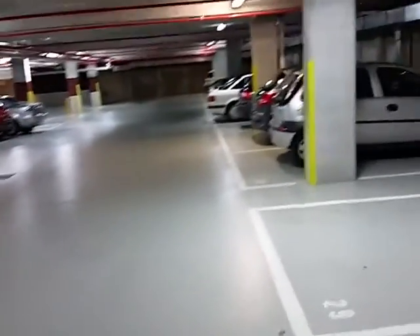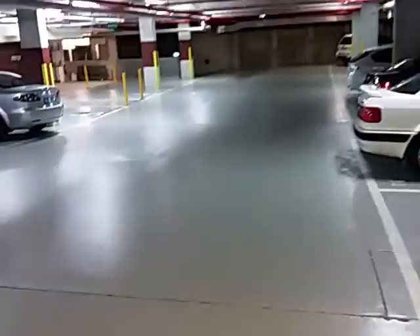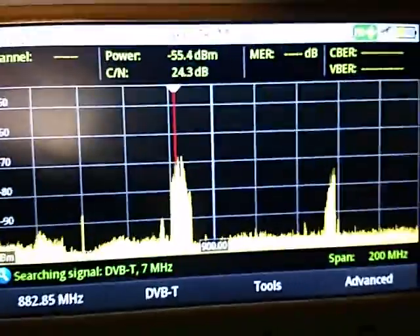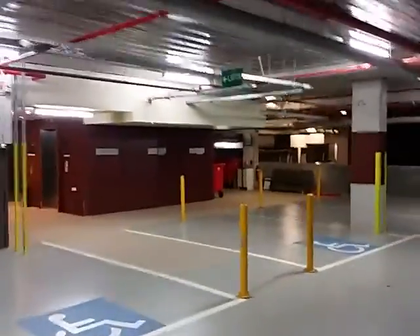As I'm walking again towards the repeater — I'm probably about 15 metres away from the antenna now — I'll just zoom in. Minus 56, minus 55 dBm. So the phone signal to the antenna is really, really good.